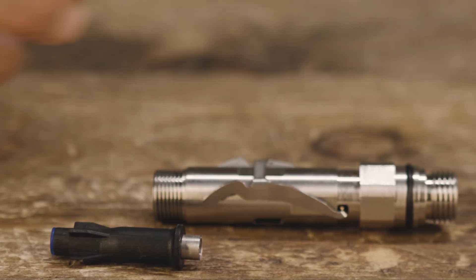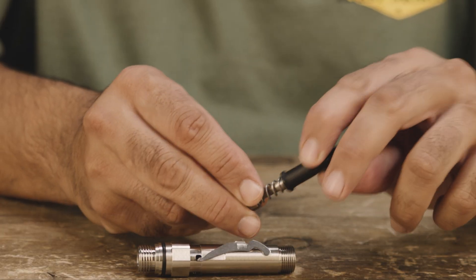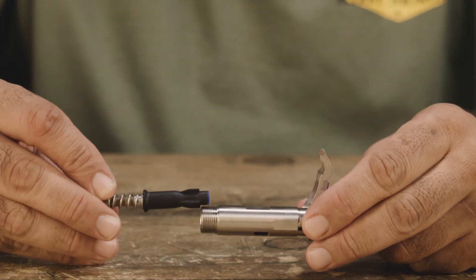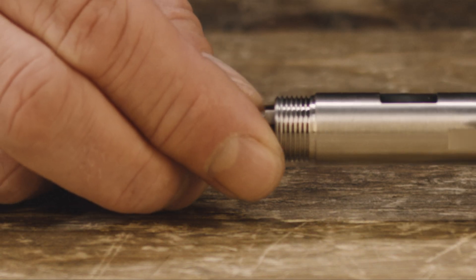Insert the balance spacer with the O-ring and spring into the stainless steel tube on the inlet valve and stop once you reach the O-ring. Apply pressure to keep the lever arm upward. Then properly align the wings found on the inlet body and insert the inlet valve into the main tube.